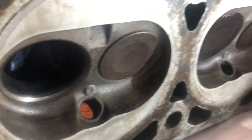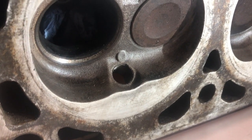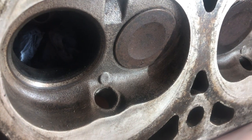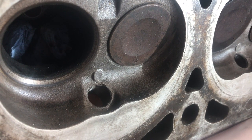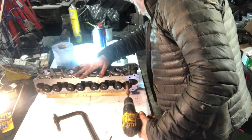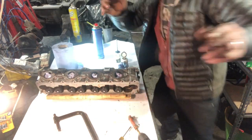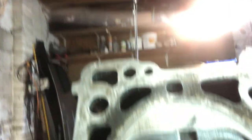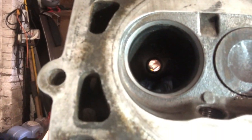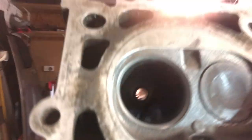There's a typical sealing face - got discolourations on it and stuff. I think I'm just going to use the fine paste and do a little bit of lapping. From last time you can see all the discolouration's gone, so I think that's fine. Don't need to do anything more than that.